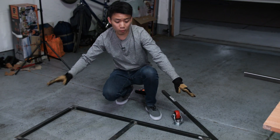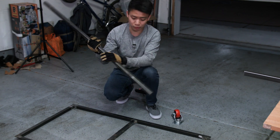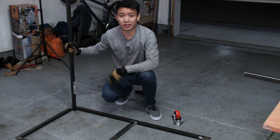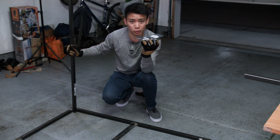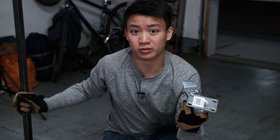We've just built our 4 foot by 2 foot frame for the tabletop, and we're going to weld these square steel tubes. They're 1 inch square and these are going to be about 2 and a half feet high, just like our glass table. But on one side they're going to be a little shorter so that we can mount these wheels on one side, so we can lift it up like a wheelbarrow to move the table around.